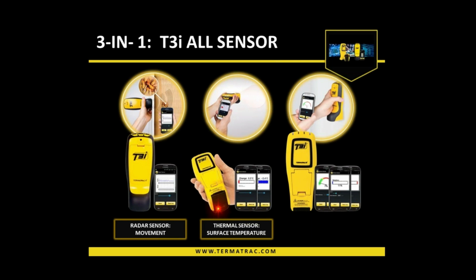Thermal sensor, it's a surface temperature device, looking for anomalies, and so forth, which may indicate the presence of insect activity and also moisture. There is a laser pointer which comes out of the bottom of that, so for obvious reasons, we don't go pointing that into anyone's faces, and so forth. And then, of course, there's the moisture sensor, which is a dual mode moisture sensor. It has a relative and a direct mode. Very simple. It's a non-invasive style moisture meter. Can work on numerous building materials, and very, very easy and accurate device.